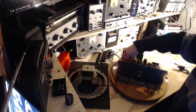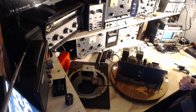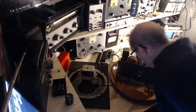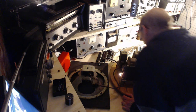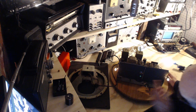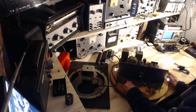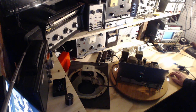All the tubes feel a little warm, including the output tube. I don't think what I'm smelling is important at all. It's just things getting warmed up. We're on band A right now, which is the regular broadcast band. But again, no antenna. We're still at 83 volts, which is a little low.